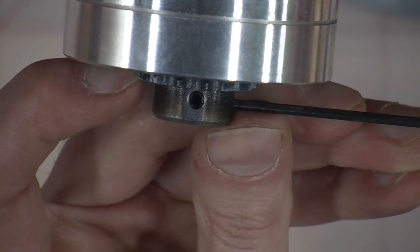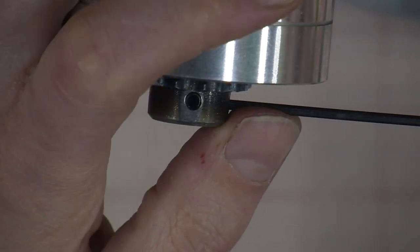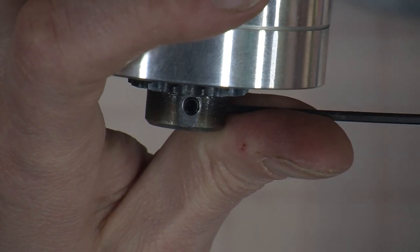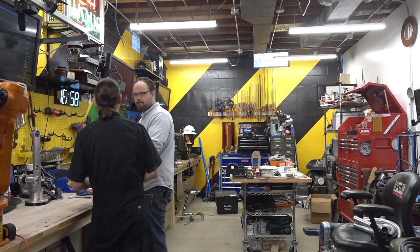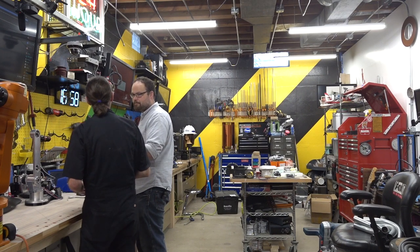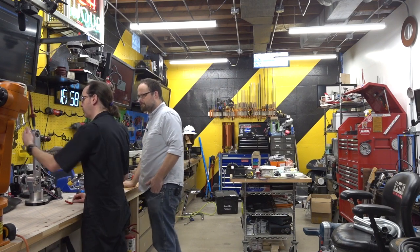I wonder if that's something where, like a little bit of hard soap, where you don't want the full Loctite, but you do want a little bit of... Hard soap? Yeah. What's that? Like hand soap. You just take and scrape the threads on the soap, and then run it in. Soap dries out. It's weak Loctite. Really? Yeah. I didn't know that. Oh, yeah. That is super cool.